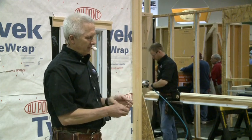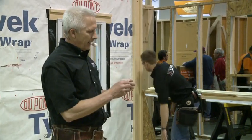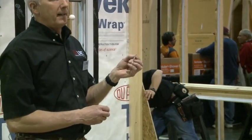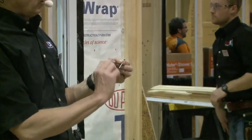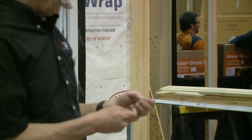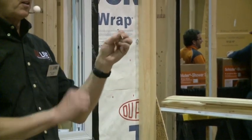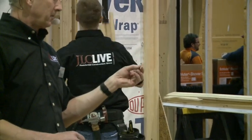I also try to use a deformed nail — either a ring shank nail or a twist nail — something that's deformed so it won't pull out as much. This is a gun nail; I broke this off the coil. Everybody uses trim guns now.